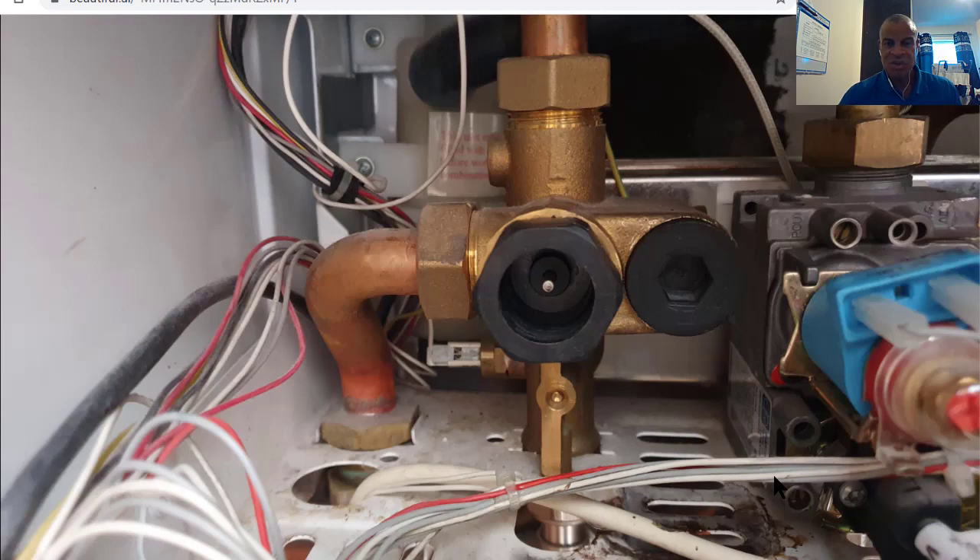I've removed the actuator motor, as you can see, and now you can see the diverter valve. On this particular unit this is also on the Heatline as well — same type of design, because basically it originated from Heatline and Glowworm adopted this particular type of design. The leak from the centre spindle there is a common point, but in this particular instance it wasn't leaking from there — it was leaking from the plug on the right-hand side, just dripping down slowly. You can see a bit of marking on the bottom panel and that's where it was dripping down.